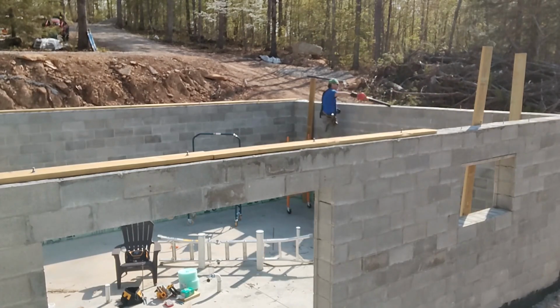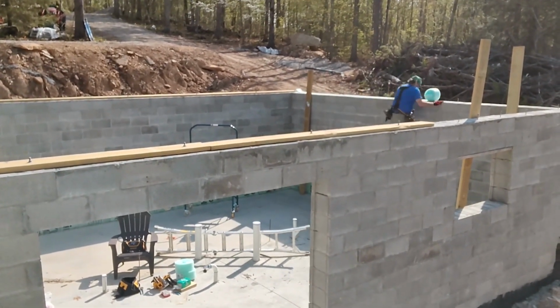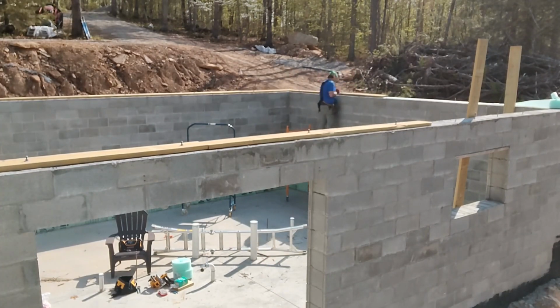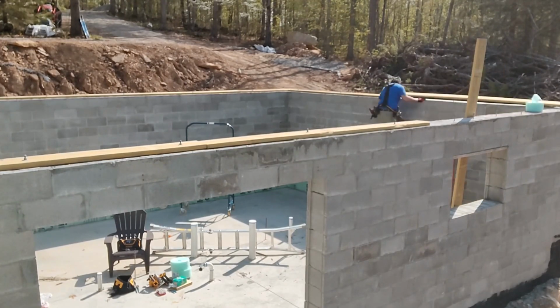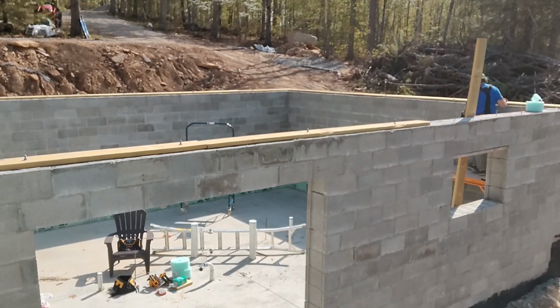So for my purposes, the sill itself is level enough, the foundation is level enough that I don't have to make any adjustments to the sill itself. I will have to shave off just a little bit on that high side, that high point that I found, from the rim joist, but that'll be easier done on wood than concrete. And it keeps me from having to raise the sill off of the foundation excessively because you really want a tight seal there as much as possible.